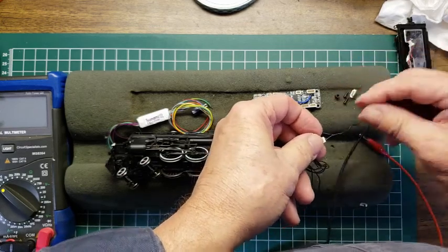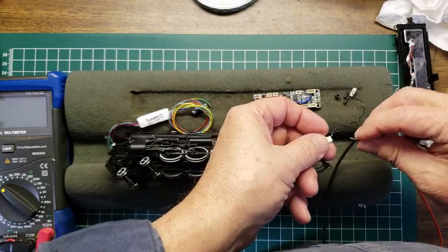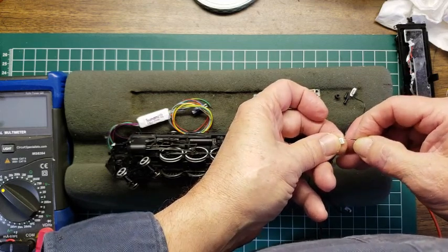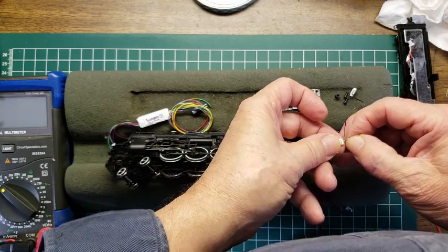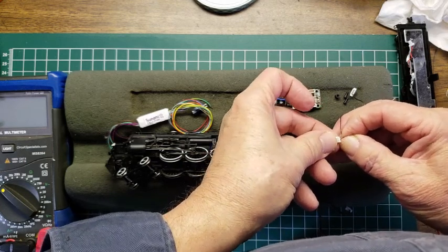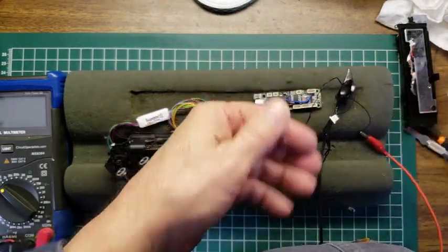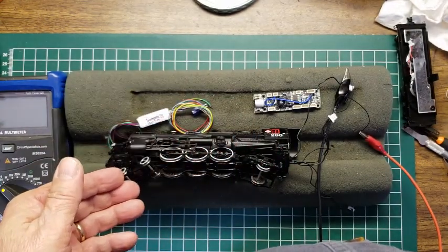I'm going to recreate the experiment here. If it in fact is an LED, it won't blow the LED up, LEDs being about 20 milliamps is all they can take. And so I have a current limiting power supply. And again, this is about $100, and you can buy it like I do at a shop. Anyway, so there you go. I plugged it in, and I'm going to go to 2 volts here.